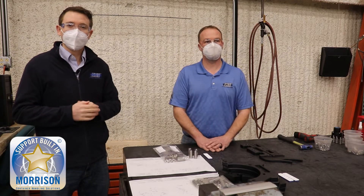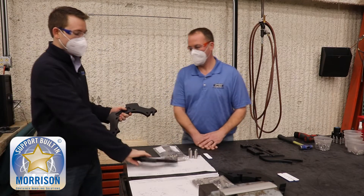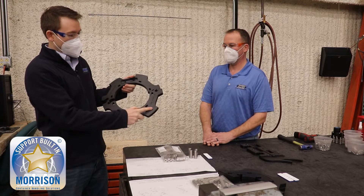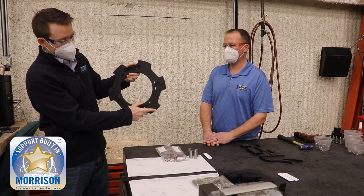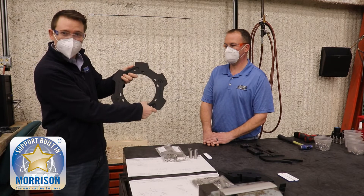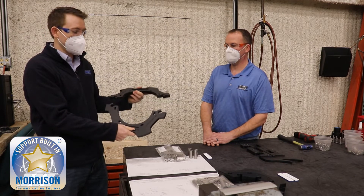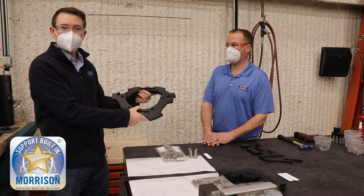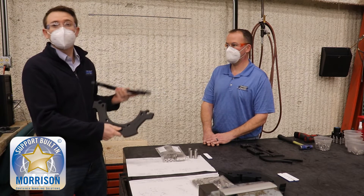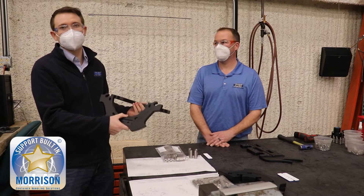We're here with Mike Norman over in our assembly area. We just took those parts off of our router and we're going to go through the assembly process. Before starting, one of the things that we'd like to highlight are some of the design approaches that we take that improve your performance and improve your functionality of your parts. One of these is our puzzle cut. You'll notice we've got the stars so that they will connect together, and that does a couple of different things. First, it makes it so that if you try to pull it apart they nest together and it creates a tighter package. Also, when you're trying to put the parts on the machine it creates lighter parts instead of having one solid piece. For operators that are unable to lift certain weight parts, by having them in multiple pieces it's easier to assemble and easier to finagle to get onto the machine in those tight space constraints.